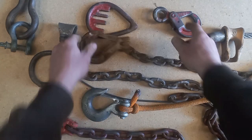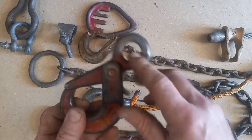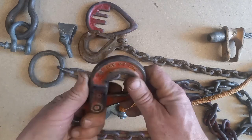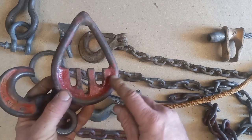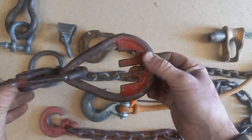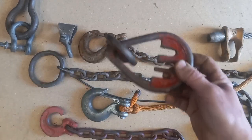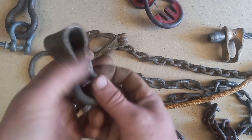This one's got a heavy latch on it — same with this one, although you can mess it up since it does have a spring. I prefer to use this on the end of my winch mainline. I use a shackle to attach it to the eye of the mainline, and this allows me to swap from one thing to another quickly. This is a chain grab I made from round stock and a piece of metal with grooves cut in it, so I can hook to a chain choker — two or three of them — and in just a second I can swap to cable if I want.